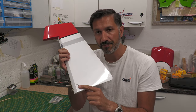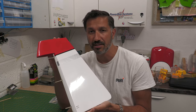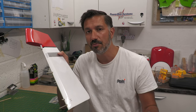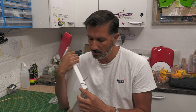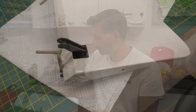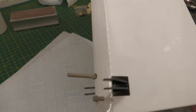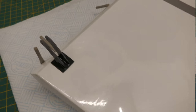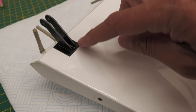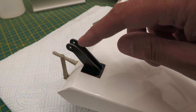So the same process as before — two more horns, one each side. The only option on this Edge at this size is to run closed loop, and all the closed loop holes and tubes are already cut out and put in for you, which is great. We'll put the horns on both sides and then attach the rudder to the fuselage. When fitting the horns, make sure you push down the back of them properly — if you don't, you can get a misalignment between the holes, which will cause you a problem.